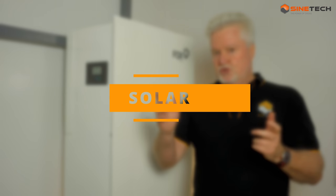This would probably give you, in its biggest configuration, around six to seven hours backup time per day. It's also important to note that because you can have solar as well, if you have a long outage, as soon as the sun rises in the morning, the unit will start recharging the batteries and you will have power. So if the batteries run out during the night during a long or multiple-day outage, as soon as the sun rises again it will start charging the unit and you will have power again.